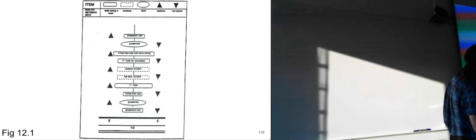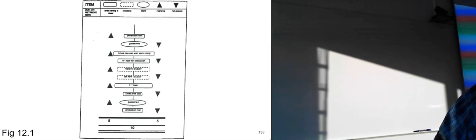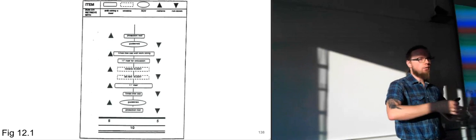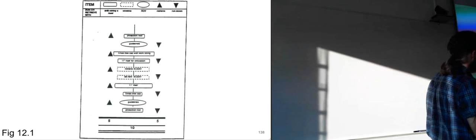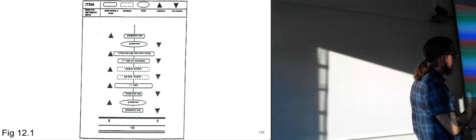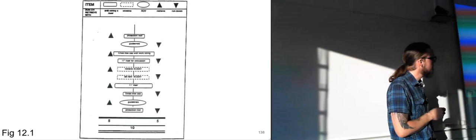Then they come down with the riser, I think it is, an 11-inch riser for circulation. So they place this down on top of the Christmas tree. And then they go into the Christmas tree with their wireline. So they go deep into the Christmas tree, down into the well where the surface-controlled subsurface safety valve is. And then they retrieve that one, pull it up.